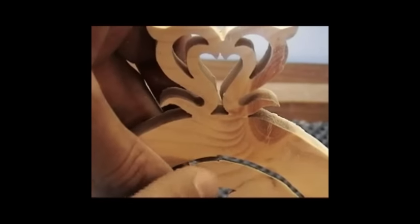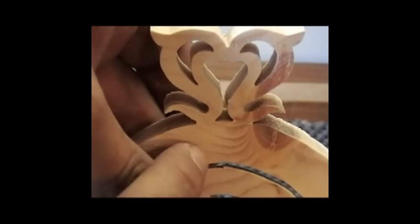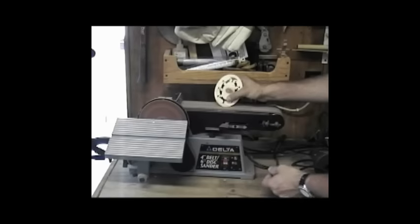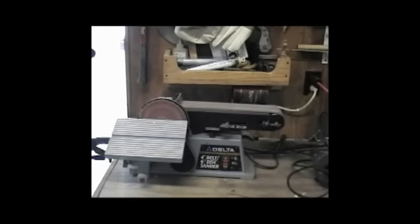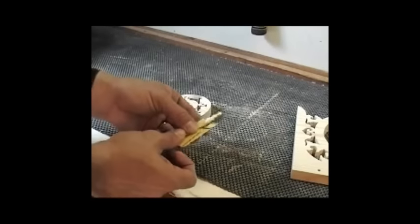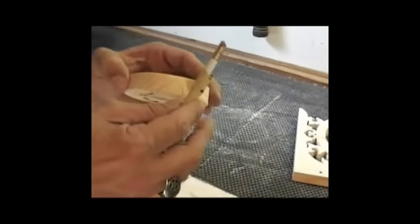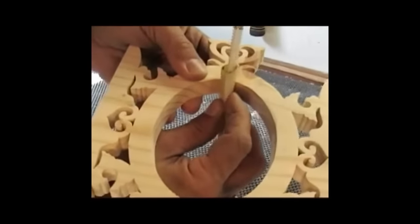When it comes to the drill hole we made for the beveled pop out, we're going to use the router on the chair back oval and also on the outside pop out, but first let's try to clean it up a bit. I'm going to give a super quick hit on the disc and belt sander, just a really quick rolling motion. Now I'll wrap a piece of sandpaper around the pencil and we'll smooth out both areas. Not too much though, or the final fit won't be uniform.